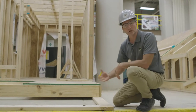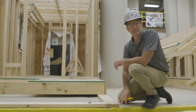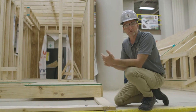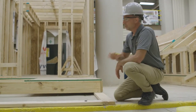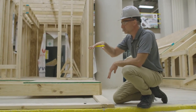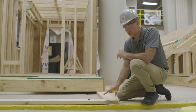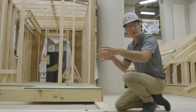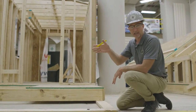Once our plates are down, we go to the next step. We can't guarantee the concrete has been poured perfectly — there's only so much variance the foundation company can pour to. We'll check all our concrete, then square up our sill plate on the foundation. We can pull cross squares and use the Pythagorean theorem — a 3-4-5 — to make sure we're square, making slight adjustments to the sill plate. Then at our third layer, the floor system, we repeat the same process. Each layer that goes up, we keep becoming more plumb, level, and square, so when we hit the top of the building, our pre-manufactured trusses land exactly where we want them.